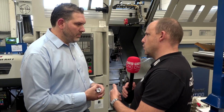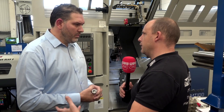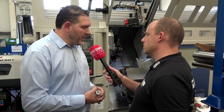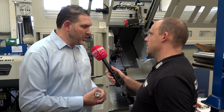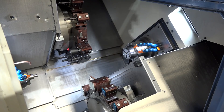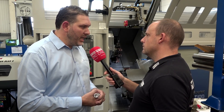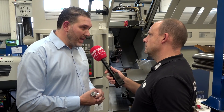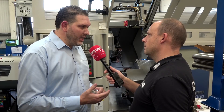With 15 tools per turret I can utilise 30 tools. Sometimes when you've got 48 tools you never actually get 48 tools mounted in a machine because you can have a lot of collision with the tools. The beauty of having that amount of tooling is you don't have to change them very often — you've got a set of fixed tools, you change job to job with minimal downtime. We purchased this as a turnkey machine. Matsuda looked after all aspects of programming and tooling, optimising every single tool station to maximise the capacity of the machine. The Y-axis on both turrets gives us flexibility not only with double tool holders on the X-axis but also on the Y-axis, which builds up the robustness and reliability of the machine tool.